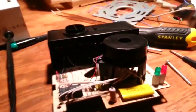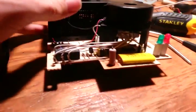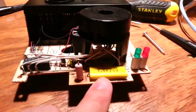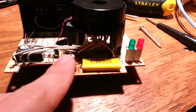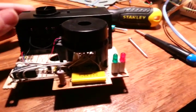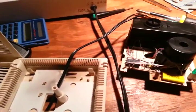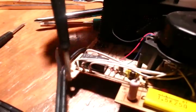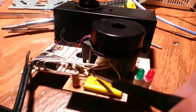So I will go ahead and permanently affix an AC cord to one of these and solder it on the inside. The detector will have to be operated with the case together because there is no transformer on these - there is no power transformer. There is a capacitor here to drop down the voltage, as well as a power resistor, and so it is not isolated from the AC line. We will run the cord through the bottom, and it connects here and here. The other wires go to the relay switches for interconnected detectors, but we are generally worried about the 120 volt connections here and here.